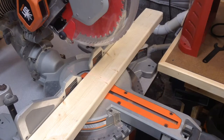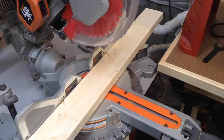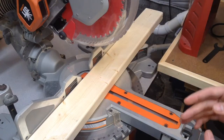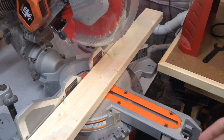I've got those marked out and since my studs are 16 inches apart, I need some room for screws to go through and into the studs. So I've oversized this and made it about 19 inches. I'm going to cut it around 19 and then trim it down to maybe 17 or 18 later — this is just going to be a rough cut.